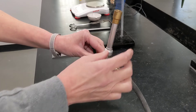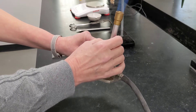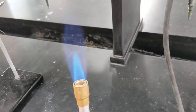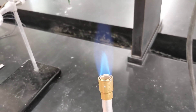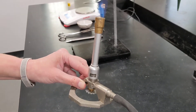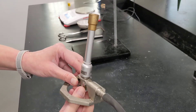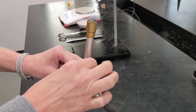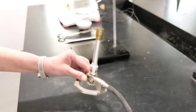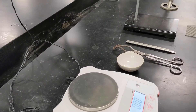I'm going to adjust this so there's no defined inner cone — it's a uniform blue color. A flame with a very well-defined inner cone is hotter; the more defined the inner cone, the hotter the flame is burning. I want to start off with a gentle flame, so I'll back that off a little bit, starting off with a medium-sized flame not burning too hot, and then I'll increase it as time goes on. My burner is all set, so I'll turn that off for now and come over to weigh out the hydrate.